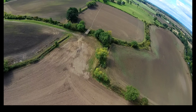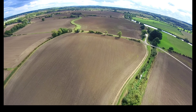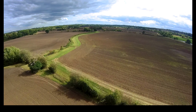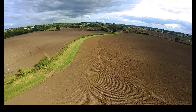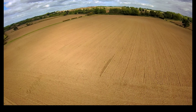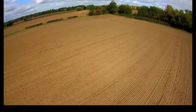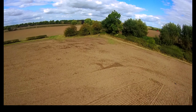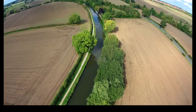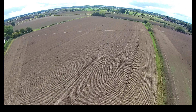I've now fitted a GPS to this drone and I've actually got it to work. On this flight I've got the GPS giving coordinates, flight distance, flight direction, altitude, and all of that. But when I hit the switch the GPS didn't actually do anything. I think I've now fixed it using the Speedybee app — I've got a Speedybee V2 flight controller with Bluetooth, so I can connect either over Bluetooth or by plugging in a USB into my phone and into the drone itself.